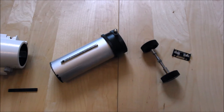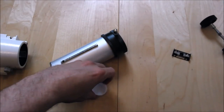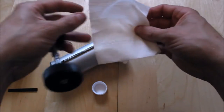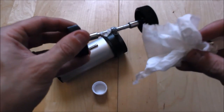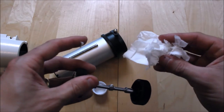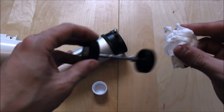What we're going to do is clean the components carefully and remove some of the old grease. To do this, we've got the trusty isopropyl alcohol. You may want to use degreasing agents like penetrating oil to remove it. Using a bit of tissue or rag, dampen the isopropyl alcohol and just start cleaning the components. Unfortunately, using tissue is a bad example — because the grease is so tacky, I wouldn't advise using tissue. This is just to demonstrate not to use tissue in this process, because it tends to stick onto the gears. Use cloth rags — that's the only way.